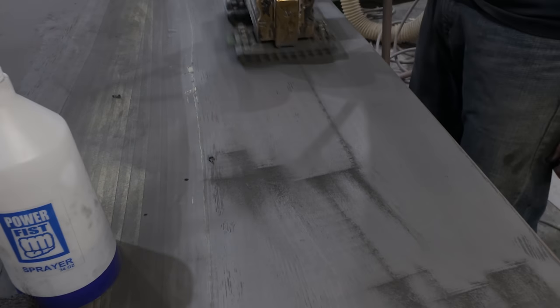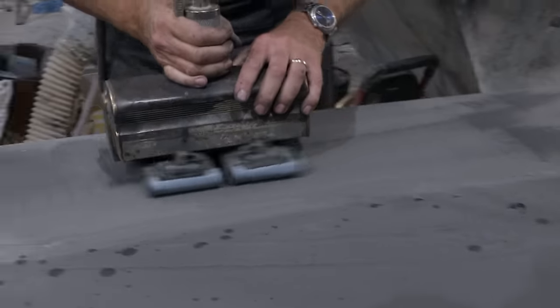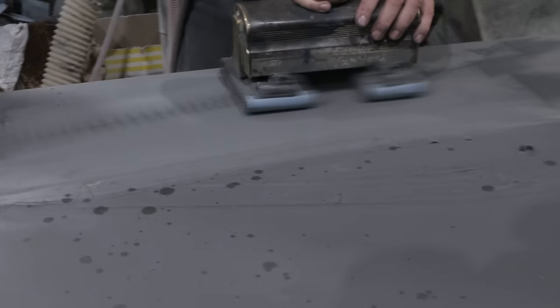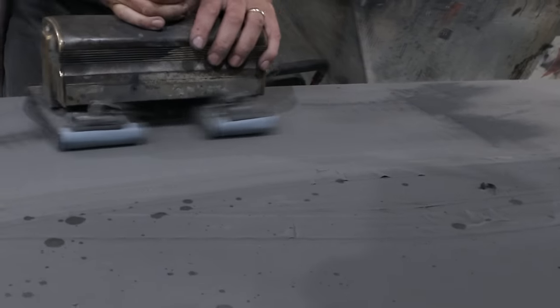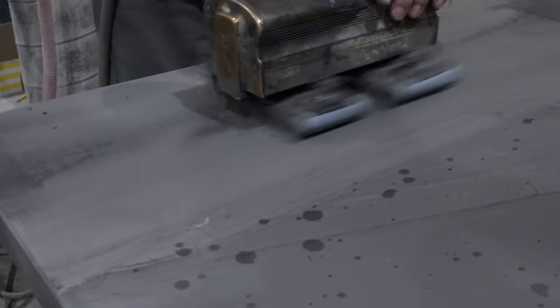So then we got Jekko to film some of this stuff, and it was actually Nicola Eddy, their filmer, that did it. So we'll leave her links in the description below. And what they're doing here right now is sanding off the metal that was sprayed on to expose the wood and then leave the little bits of metal in the deeper part of the grain. The wood was wire brushed before all this to kind of expose those parts of the grain, and we're just trying to leave the metal in there.